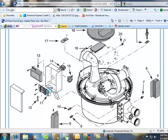Like I said a couple of YouTubes ago, if you think it's a blower, don't bypass any safeties. On the fan wall, F1 and F2, all these wires are marked. F1 normally goes from the hot side of your terminal board right into the fan wall that says F1. F2 usually goes right from F2 to your blower. So you can do two things. You can leave F1 on and turn it on and see if the fan wall is giving power to the blower. So you want to check terminal F2 to ground or common for voltage.